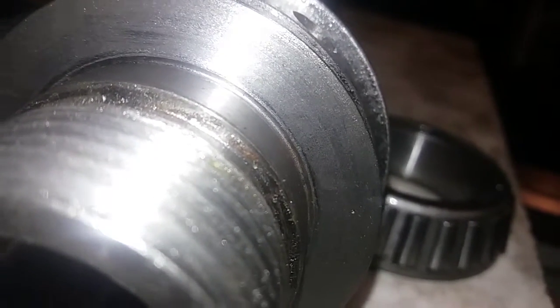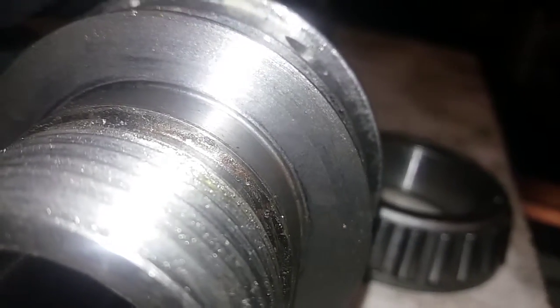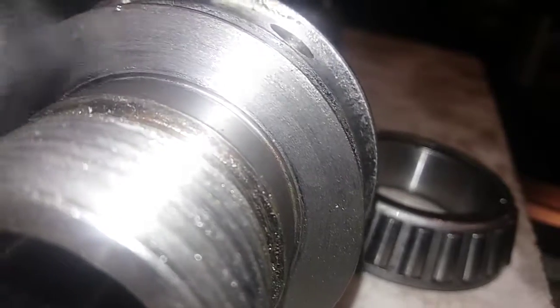Let me get a good focus on here. See, that surface is a lot better - I put a straight edge across here and that looks much better. I did grind this; you've probably already seen those other videos, but I did try to use my post grinder and the surface did come out pretty good. But it's still got a different kind of finish and a slightly conical thing to it, so I was going to try working with a smaller grit stone.